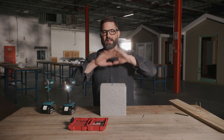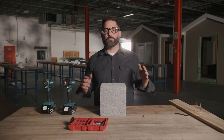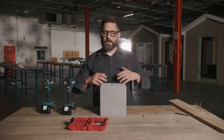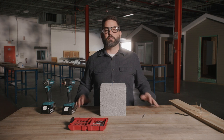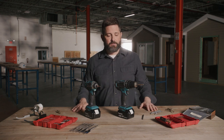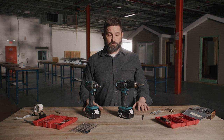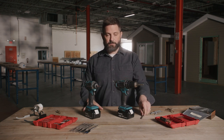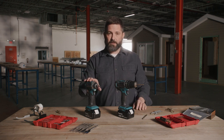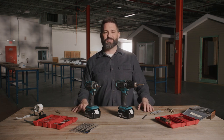Again, lots of different applications, lots of different building materials, lots of different equipment. Get to know all of it, because you never know — with American architectural styles and residences being all shapes and sizes and all different building materials, get to know everything. Now you should have a basic understanding of the difference between your cordless drill and your impact driver. To recap: the drill is more precise and also accepts smooth shank bits. Impact drivers are more powerful and only have that one speed. Always take safety precautions before using any drill or driver. Thanks for joining us, and we'll see you guys in the next video.